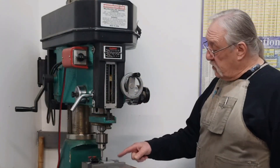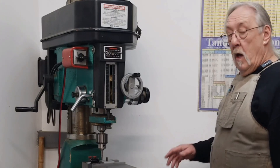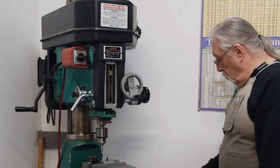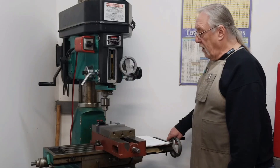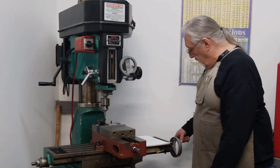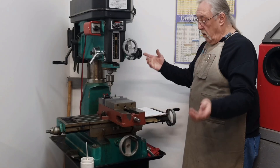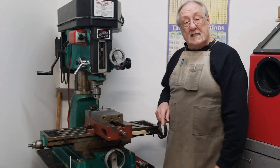And we have to bring that spindle back — the x-axis — back to the center. We have backlash on machines; all machines have backlash. Raise your spindle up. We moved off five hundred thousandths, so we count back five revolutions. But our backlash was this way — there's twenty thousandths backlash. Move one revolution past, so that's six hundred thousandths, and come back clockwise. Zero, zero. You're on zero, zero. DRO says zero, zero. Your dials say zero, zero.